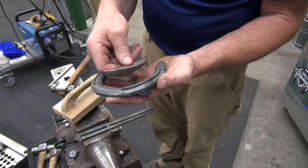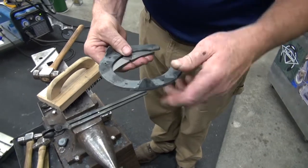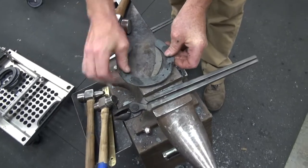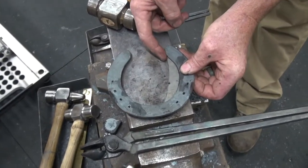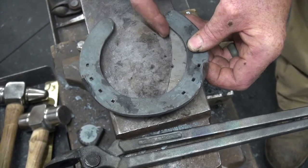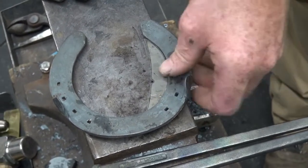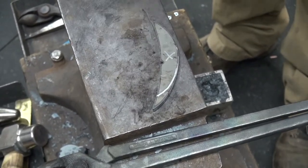You can put it on the medial or the lateral side of the shoe for collateral ligaments. I'm going to put it in a position, trace it on the backside, then grind or cut that out. So I'm going to put it on the lateral side. Here's the heel check — I align one point of it up with the heel check so that it fits nice and straight with that area. I grab my Sharpie and mark it where it needs to be cut or ground, marking with an X so I know which side I marked it from.